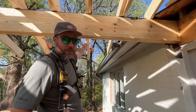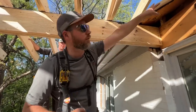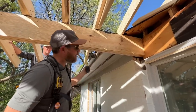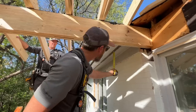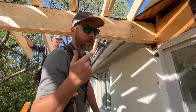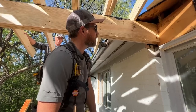We're gonna clip off these rafter tails and I have to figure out where to clip them so that our soffit height matches this existing soffit and our two roof lines match, and the gutter line can be the same. We know that roof's the same pitch as our new roof, so I'm just gonna measure out from framing and mark where the framing ends. The weird thing is this is gonna look a lot deeper because we don't have four inches of siding — this brick on our addition. This really shows 16 inches but on the addition part it's gonna look like about 20 inches because they've got four inches of siding. That was confusing me — why is this overhang coming out so much further to be level — but then I figured it out. So we're gonna clip these off and hopefully get it aligned.